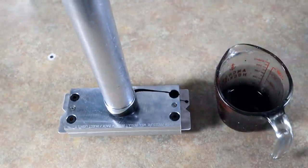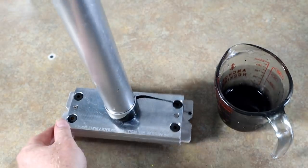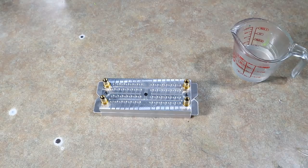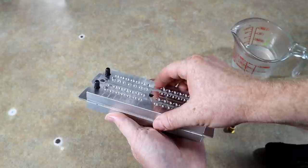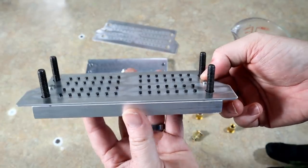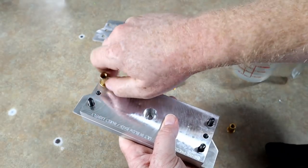Next round of black pupils - just hold a little bit of pressure. You don't really need to force the issue - it's actually recommended that you don't just blow plastic in there as hard as you can. Warning: Dead On Plastic may look like water - do not drink it. Now it's time to open the mold again. We just did the black pupils - remove just this top sheet and there are the black pupils. If you accidentally pop this up it may be difficult to get everything back in place, so pay attention. Now close the mold right side up.